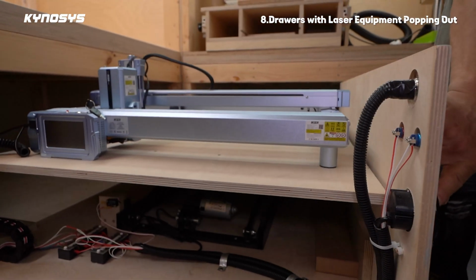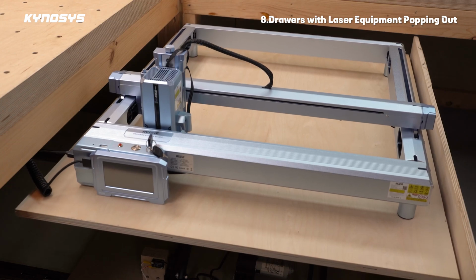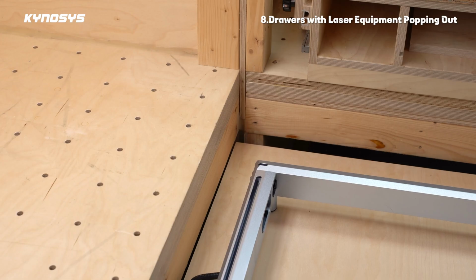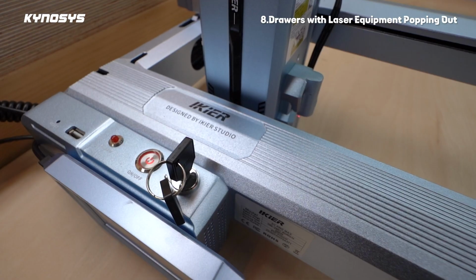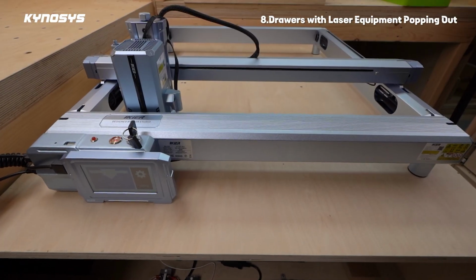The moment the lift table is raised, the forward-reverse switch is deactivated, and the table is not activated until the end. This means that with the table up, you can't reverse it and go inside. It is a system that can guarantee safety with a simple limit switch. You will also find it useful when making equipment that performs double action.